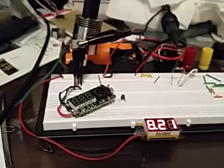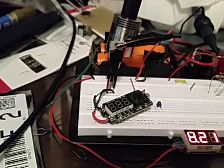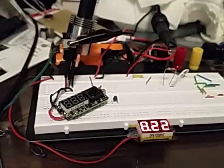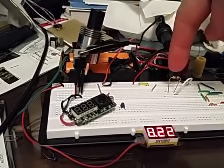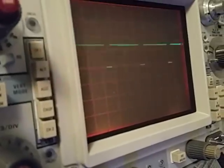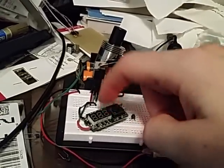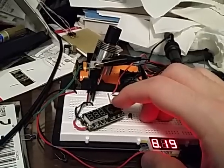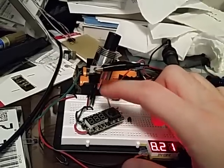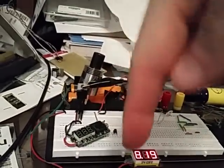It works. It doesn't do everything that a 555 does, but if you're looking to build a trash box, this is only an addition of a MOSFET and a resistor. I don't even have the resistor in there — actually you don't even need the resistor, because I've been running this thing without it. It gives a definite zero — a different on and off. However, if you decide to make a bypass and run it straight regulated series, you will need the resistor. If you decide to switch this to a switch that just runs off of the positive end of the MOSFET, you're going to need a resistor. Consider that. Questions, comments, concerns — let me know in the comments. Duters out.